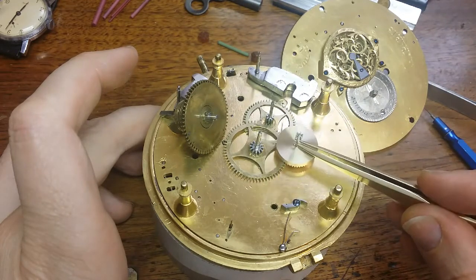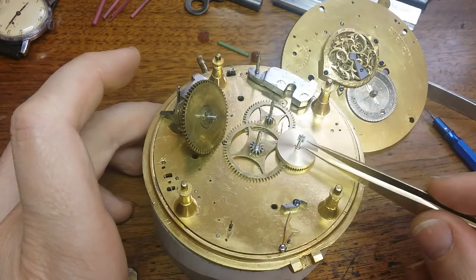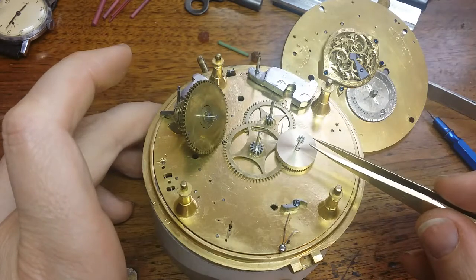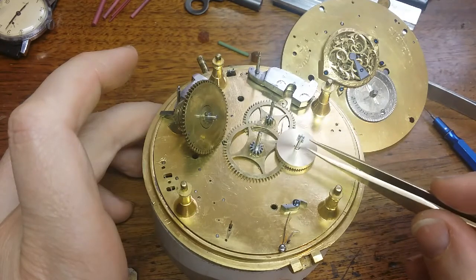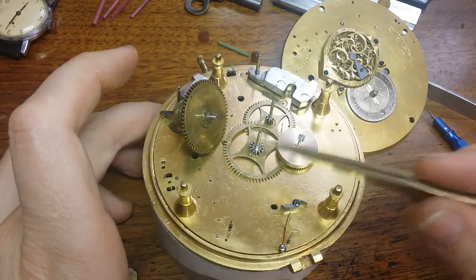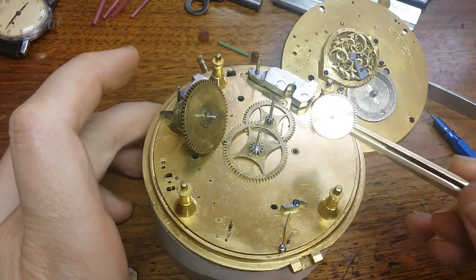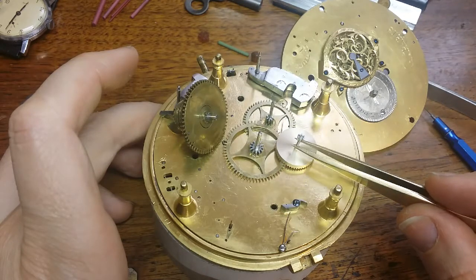The idea of gold plating is to help prevent the brass from tarnishing and corroding, and there's a certain aesthetic appeal to it as well — though that aesthetic aspect isn't usually appreciated by the owner. I'm going to use a different method; I'm still going to plate it, but the gold is probably not going to match the original pieces exactly. Also, you can still see the machining marks — we need to polish those off before we electroplate.